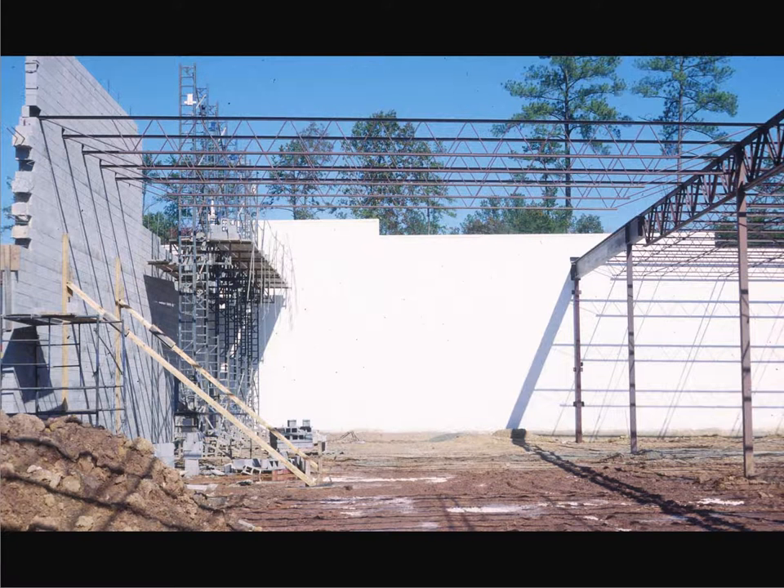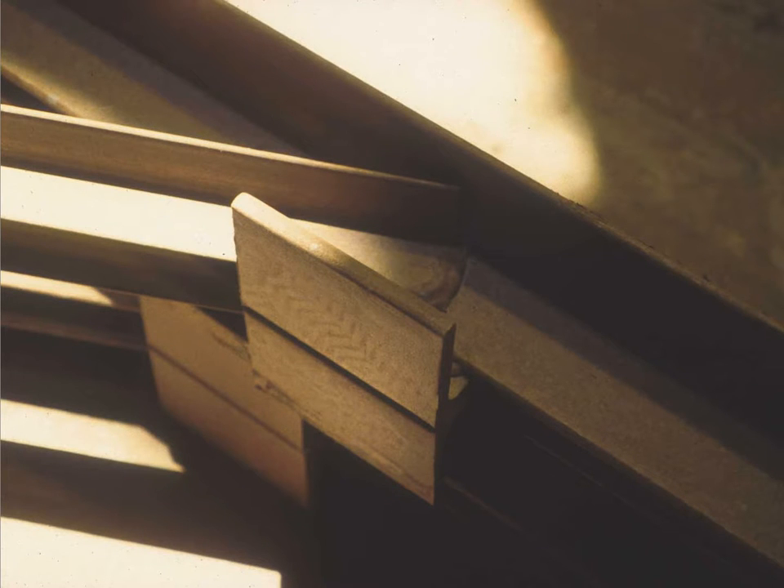Looking at trusses of this sort: at the end of every truss is an end bearing assembly — a very descriptive term meaning the end of the truss bears on something in the assembly. In a close-up view, we have the top chord members and the last web member, which must be at a slope so it doesn't interfere with the end bearing assembly. The end bearing assembly consists of two angles, typically at least 4 inches deep — in our case, 5 inches. The top chord and bottom chord of the truss are double angles, as are the web members and the end bearing assembly angles.